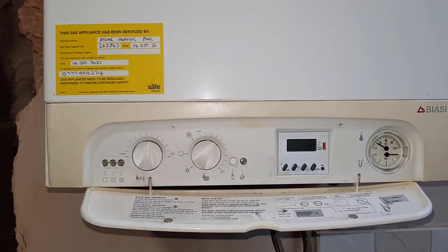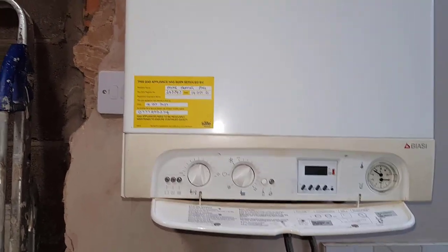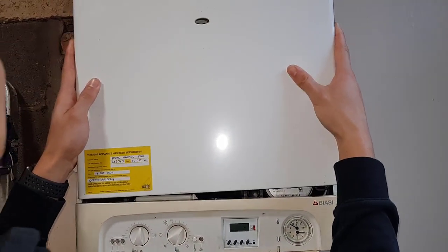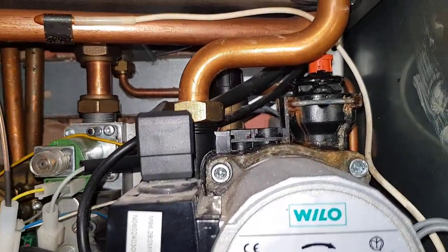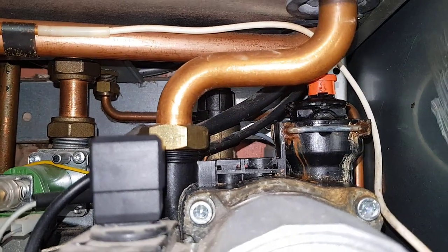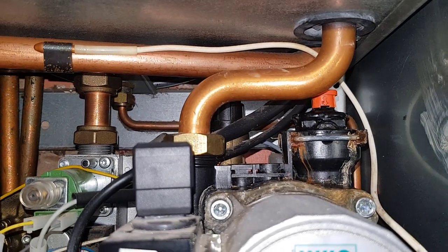The first thing I've observed, you can see there's no pressure in the boiler. So we're going to get inside it. Remove the screws on the top and this front panel just slides off. I'm having a look at the boiler closer and I can see that the auto air vent has been leaking. That definitely needs replacing and you can see the corrosion. So that's the first thing we're going to need to change.